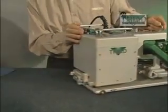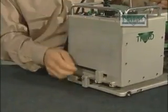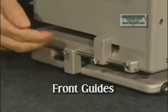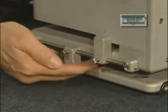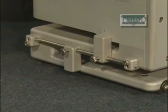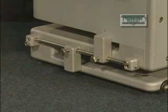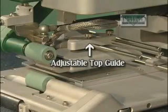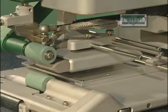The guiding system on the Triad Wedge Welder, both in the front and in the rear, provides accuracy in your seam width and easy means to line up the material. Front guides are adjustable and pre-position the material as it enters into the S-channel for welding. In addition, there is an adjustable top guide for alignment of the top sheet of material to the edge of the specific wedge size being used. This guide will stay on the machine for most all-weld finishes.